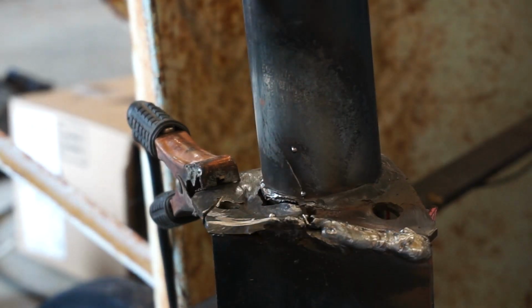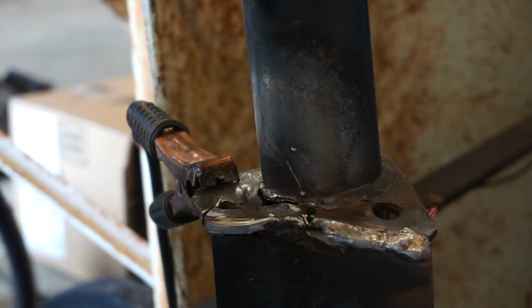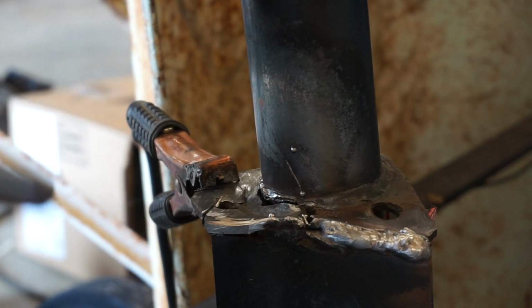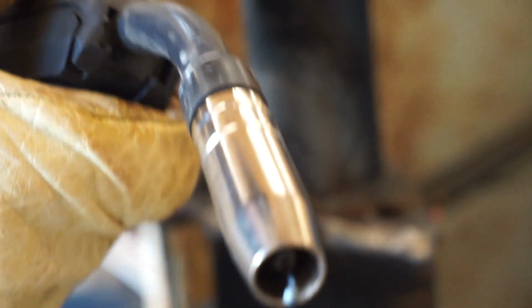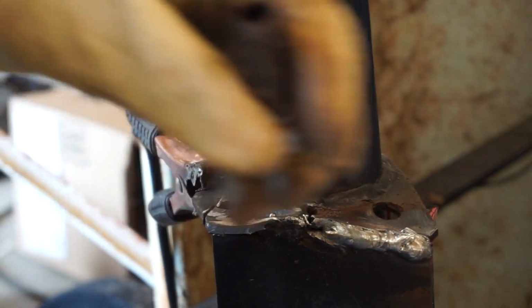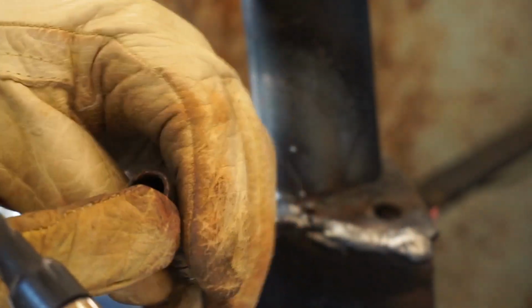Alrighty, we're back. We weren't able to figure out the lens cover, so hope this didn't hurt your eyes. If it does, cover up the weld part with your fingertips temporarily. The only thing I changed on the welder as far as buying parts goes is I replaced this outer nozzle shield, or nozzle, and the one I got back with the welder was beat all to pieces and all closed up, and I think you probably saw that on the other video. However, I just got through taking a round punch and driving it through there and opened it up.